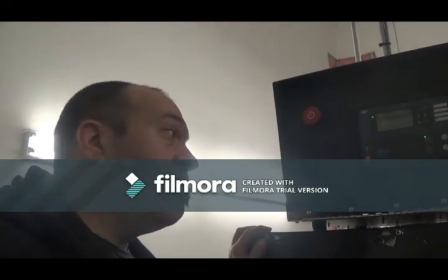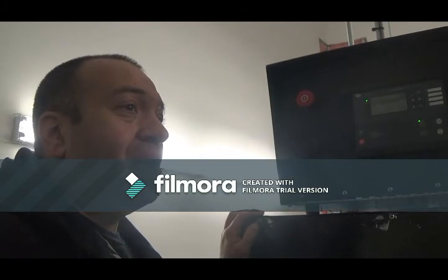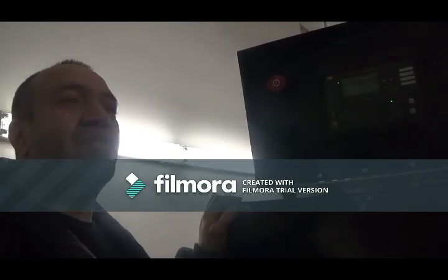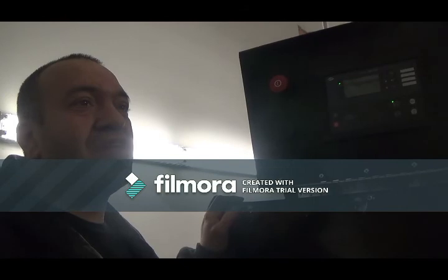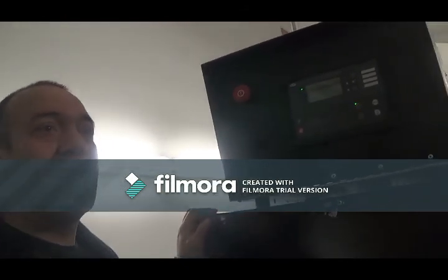do a run for half an hour? Yeah, for 5 minutes, no more than 5 minutes. For multiple reasons, generators don't like to run dry without any load on them. So, one thing, you preserve the generator, but if you run it less time, right, on the weekly.